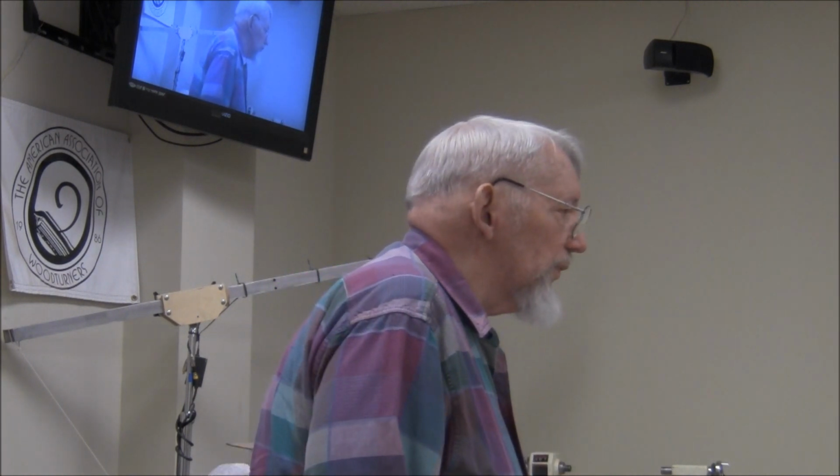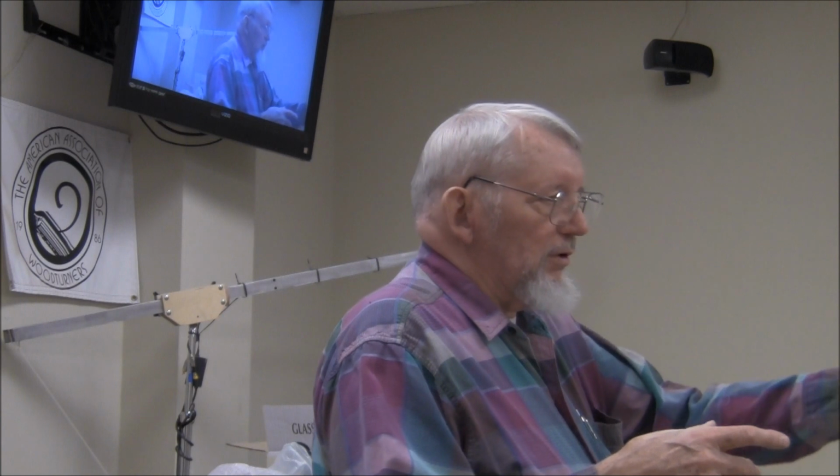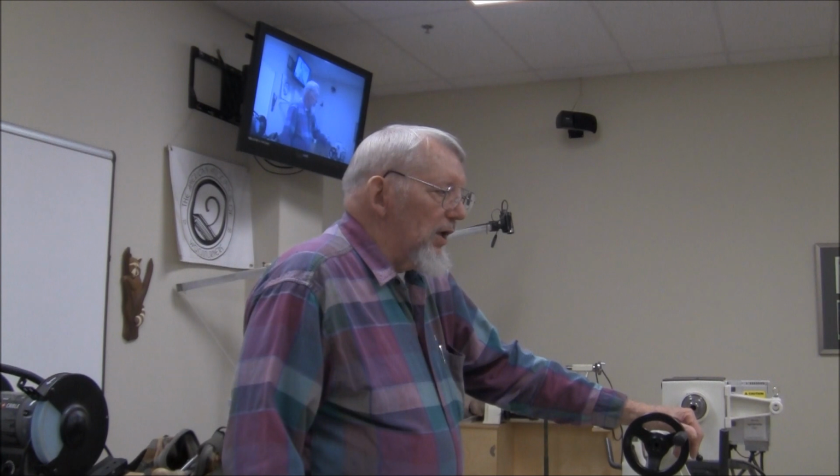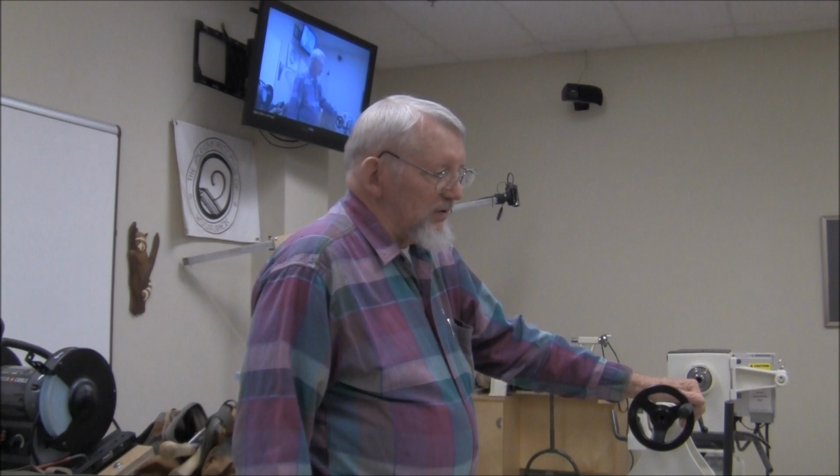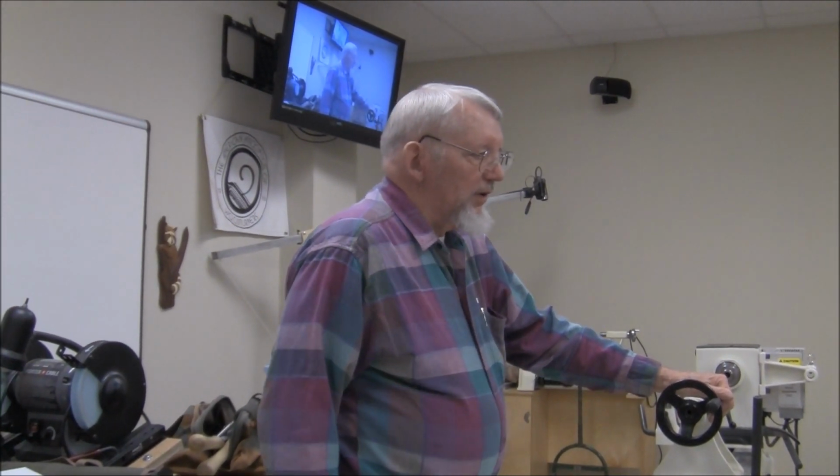It's soft. That's the real advantage to the anneal state, is you can grind it better, you can bend it better. That's my conclusion. Now, all of this stuff, everything Mike was talking about and everything I've been passing around, those are hard, ready to run in a metal lathe, or grind your own tool for a metal lathe. It's in the hard state, it's not annealed. If you dig around, you can find annealed high-speed steel, which means it's going to be a lot easier to grind, and it comes in bars.